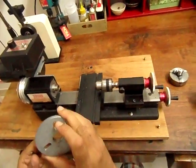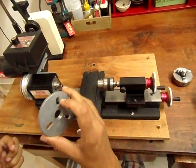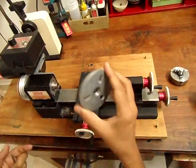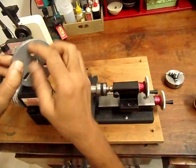The face plate is important when you're going to use a lathe dog and want to turn between centers — that's when this would be of use. The dog basically sits inside these holes on the face plate.